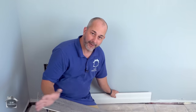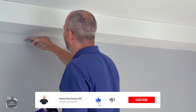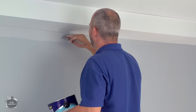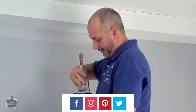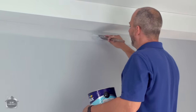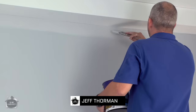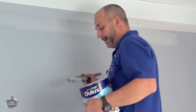If you install your drywall with a little gap under the floor you have lots of room for expansion and contraction with any kind of flooring you install. Now, for the second coat: on the first coat you can do the cut after the roll — there's no rule about that. But on the second coat you really want to do all the cutting-in details on each individual section of wall and then roll it right away while it's wet. Paint nowadays can dry in about 20 minutes, so you really want to go wet edge on wet edge. Having a good technique to finish quickly is important.